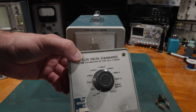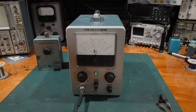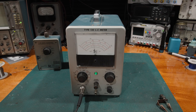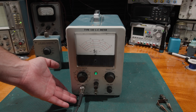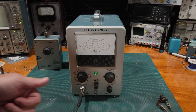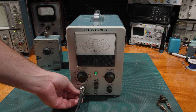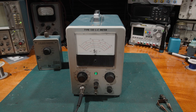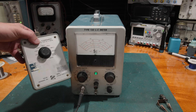The capacitors in the S30 are high quality but not exotic. However, the ratios are what's important on this unit as opposed to the absolutes. If we go to absolutes, some things are easier, some things are harder. Can it be done? Yes. Hopefully you have a way to characterize the components you're planning to use as accurately as possible — that gives you the absolutes. Then you need to minimize the capacitance at the test point, keeping in mind the test frequency of around 133 kilohertz. I would characterize those caps at 133 kilohertz, get their values as accurately as possible, minimize stray capacitance on the test fixture, and that gives you the closest accuracy you can get on an LC meter without the delta standard.